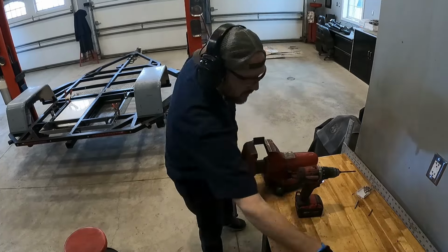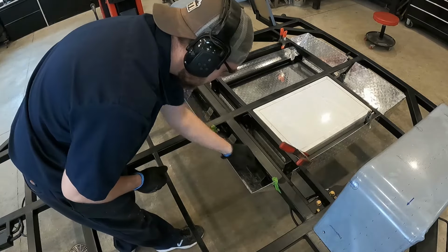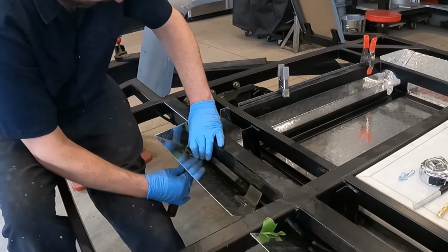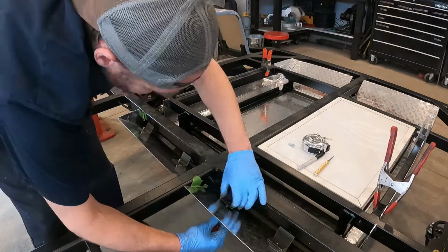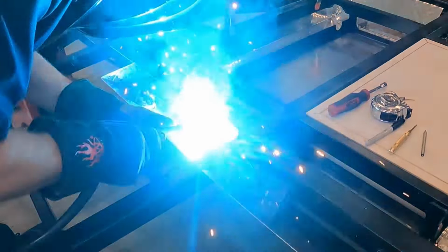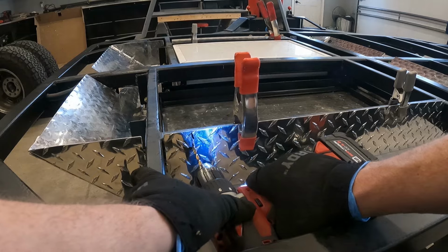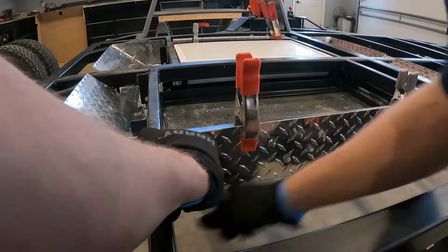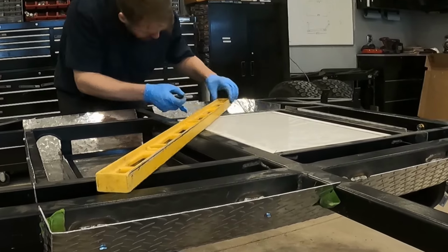And to answer that question, I'm going pretty simple. I'm gonna build some simple little brackets in the front made out of some angle iron. I drilled and tapped some holes through them. What I'll end up doing is bolting them to the sheet metal first, and then I'll weld them in place. And on the sides, I'm just using some simple self-tapping screws. And last but not least, some minor trimming where it sticks above the deck of the trailer.